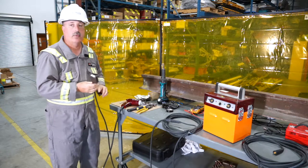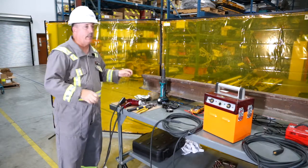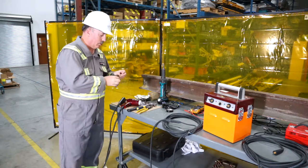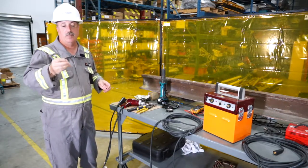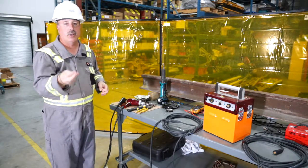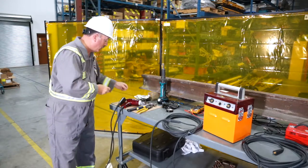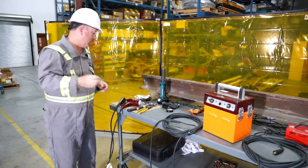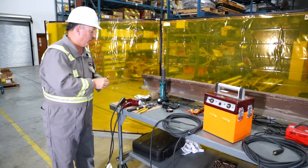Here's your ground — it's a magnetic ground, and we also have a clamp available as well. Then you need your bullet or your 8mm pin. The significant difference between this and other solutions is there is actually a fuse wire attached to the pin. We'll talk about that shortly. Then there are your ceramics or ferrules.